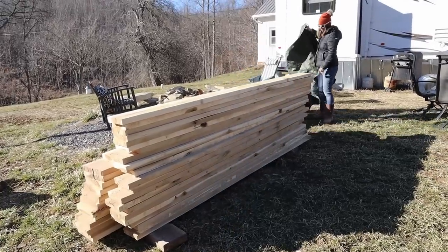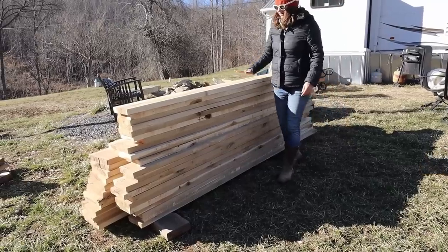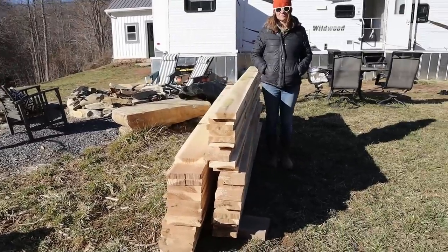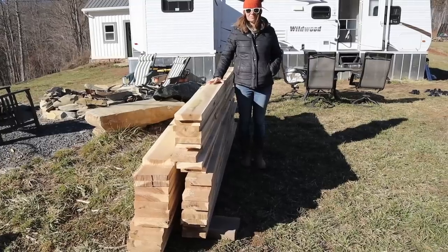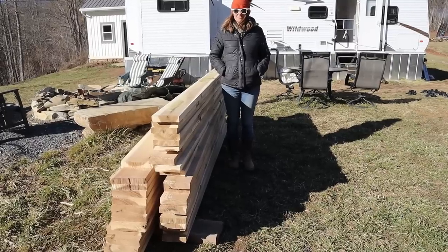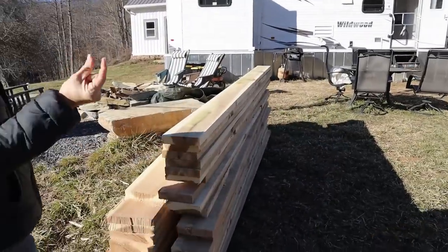All right, there's some beautiful poplar, and we're just making this thing green too, meaning that we're cutting it and nailing it together. We did that a lot of things on the shed and it worked out just fine. For the deck boards, we're gonna put them side by side, and then as these deck boards shrink a little bit, they'll provide a bigger gap. So we're gonna have the gap be no more than like a 16th of an inch right now. And as they shrink, we'll probably end up with like an eighth to a 3/16th inch gap. Month or two, we'll have a gap like that.